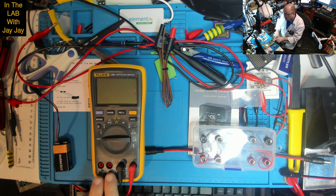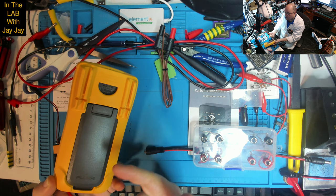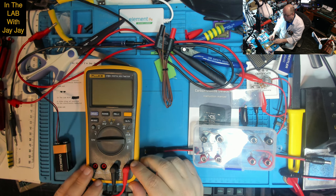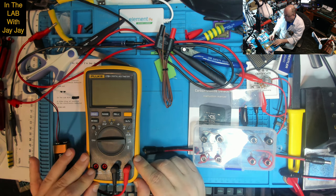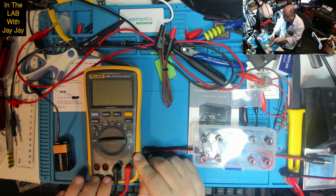The other two ports on the left are fused. The high-power one can measure up to 10 amps — if you exceed that, the fuse will blow. For milliamps and microamps, the fuse is only rated to 400 milliamps. We don't want to blow our fuses because then you have to take the meter apart, pop the back off, find the fuse, get a suitable replacement, and put it back in. Just be sensible about what you plug it into.